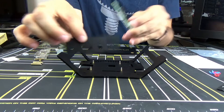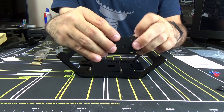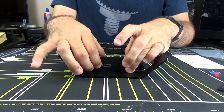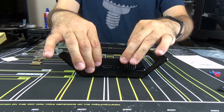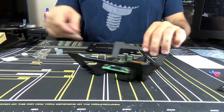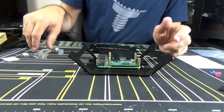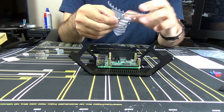Now that we've got all of these in, what we're going to do is we're going to take the HDMI side panel part and we're just going to place it along our Pi here, like so. Now we're going to put the four mounting holes onto all four screws, just like so. Now we're going to take the last four nuts here and we're going to put them all in all the way around. Now that we have all of these nuts that are nice and tightened down, double check that they are tightened before continuing forward.